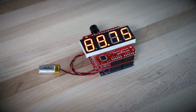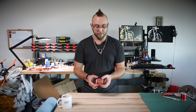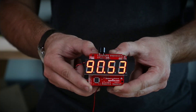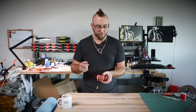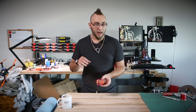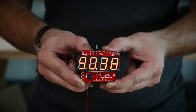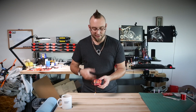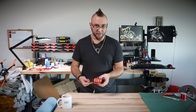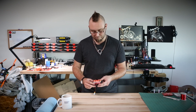This is a simple example by our engineer Mike Gruson, who did the layout for this breakout board. All it's doing is measuring the amount of charge leaving this little battery that's powering the whole thing. You'll hear it beep maybe once every 15 seconds — that's when it's getting an interrupt from the coulomb counter board. The coulomb counter works by throwing an interrupt every time it measures 0.614 coulombs. Because of the current consumption of this project it beeps about every 15 seconds, and as it does that, knowing the battery was at full charge when turned on, it's subtracting the charge coming out of the battery and showing you a percentage of how much charge is left. Right now we're at about 90 percent.